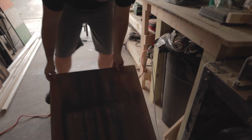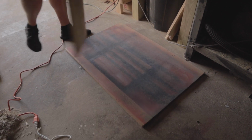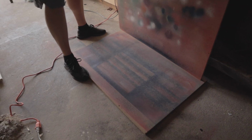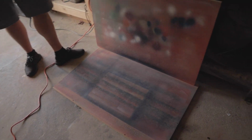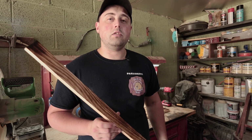We're going to go lay this down in an area that we have prepped for paint. This is going to get messy, so you're going to want to have some drop cloth, some cardboard, or some boards that we have set up over here. Just like with the burns, we want consistency. We want to work in light coats, because you can always add more paint, but you can't take any off.